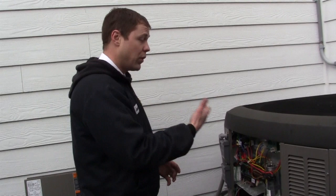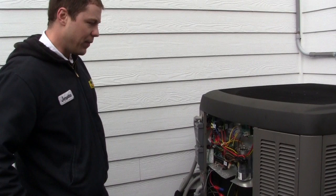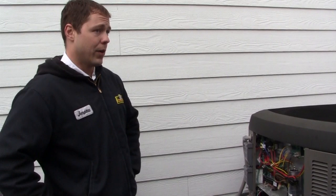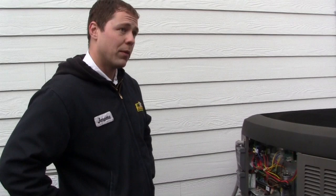This is one of the big things about heat pumps that a lot of people notice — they'll say their heat pump is making a lot of noise or acting unusual. A lot of times what that actually is is a normal defrost function. So what we're going to do here is put this unit into defrost to show you. It's cold enough out here we can certainly make this thing go into defrost so we can show homeowners what to expect from their heat pump.